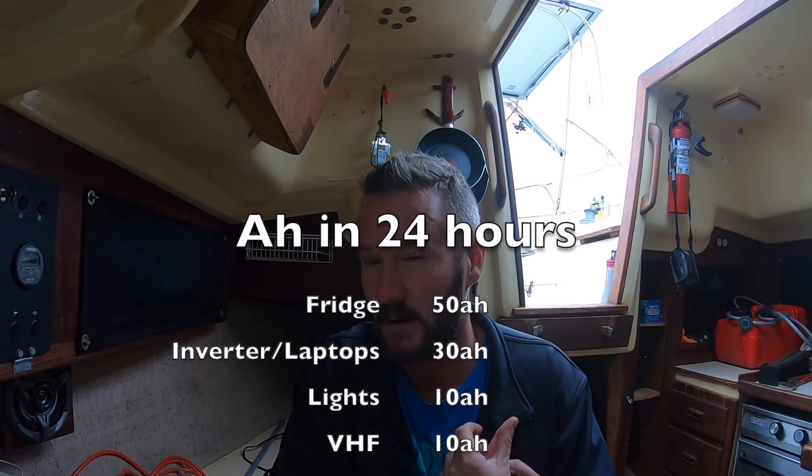You have to make a whole spreadsheet of this — the fridge uses 50 amp hours in a 24-hour period. I'm going to use the VHF and it pulls half an amp for this many hours, so I need five amp hours for that; five for this, 10 for this, et cetera. Lady K, while being lived on at anchor, was pulling about 170 amp hours a day. About 75 of that was the fridge; the other hundred was charging laptops, making YouTube videos, charging camera equipment, and on and on. You probably won't use 170 a day. You have to figure out how much you're drawing and accommodate it, then add 50% or 25% with a little bigger batteries to make sure you're okay.